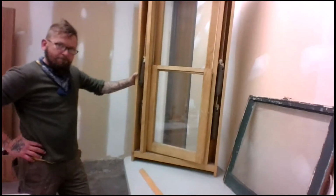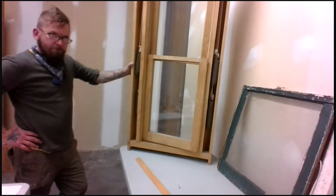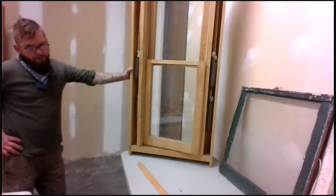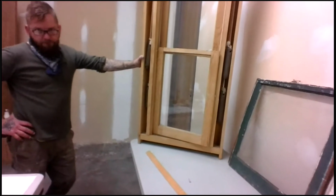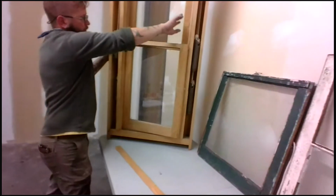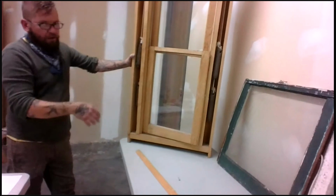So it really solves many, many purposes. Instead of peeling off the molding that has 20 coats of paint, or worrying about how you're going to tie your sash cord on your weights, it solves some problems. So we encourage you to think about the sash or jamb liners that you can use in your windows. They're really easy to use, really easy to install, and they will replace the weights. If you open it up and you don't see any weights...